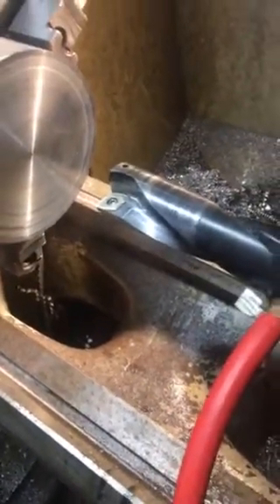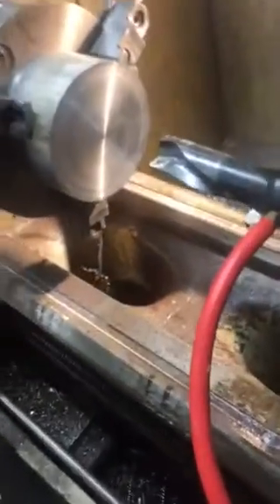It takes pretty good horsepower to run this drill bit. It's approximately an inch and three quarters. Coolant through — got it hooked up to the spout here. Running at about 450 RPM, which pretty much is babying the thing, but the lathe can't handle much more than that. So let's give it a whirl.